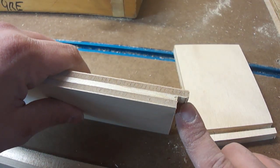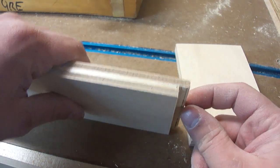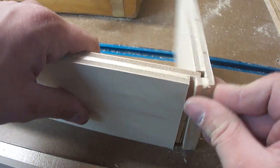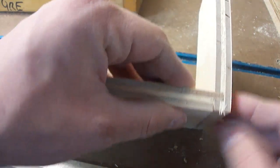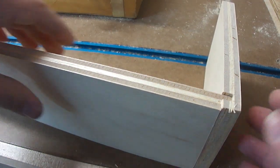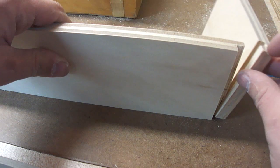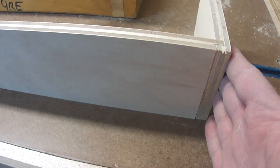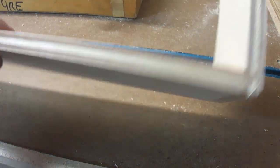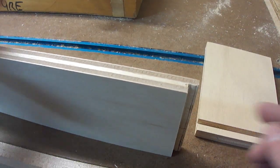After a change in the location of the stop block, I was able to cut this rabbet. This is going to be the lock rabbet on the front and back of the drawer. As you can see, if I put the pretend drawer side in, it's a nice tight joint — it doesn't come apart by shaking, yet I don't have to pound it in. If it's too tight and I have to hammer it in, I risk breaking out this little part right here. So you want a snug fit, but if you have to use more than just slight hand pressure to put it together, it's a little too tight. Now that I know this rabbet is correct, I can go ahead and cut it on the radial arm saw.